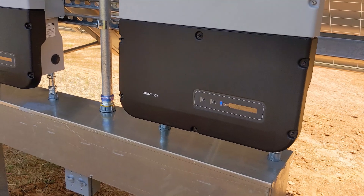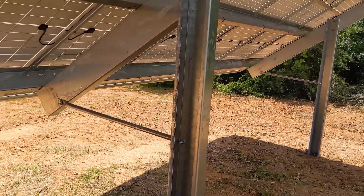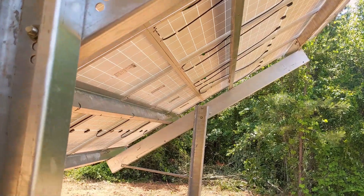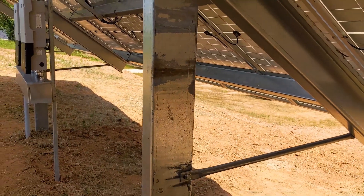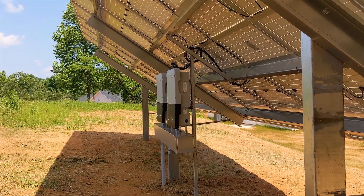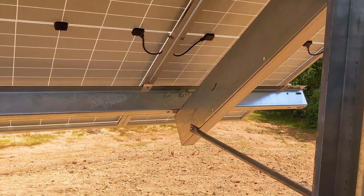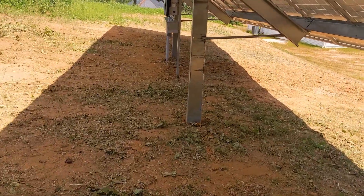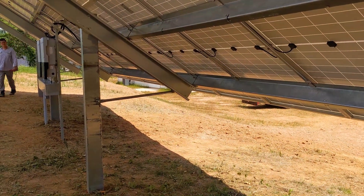So occasionally instead of doing a Solark, we'll work in an SMA job. Well, I hope you got something out of it. The Sinclair ground mount - as you can see how simple it is, very easy to adjust the angle. It's got a little protractor on it so you can adjust and put this wherever you want. It's not a seasonal adjust - once this thing is built, very hard to make an adjustment. You want to pretty much set it at your latitude and forget it forever. So that's what we typically do. And this is the last of the old-style purlins - we've been building some with the new design. We usually start that first post now with a purlin overhanging, so you'll be seeing the new Sinclair design out of us from here on out.